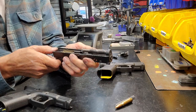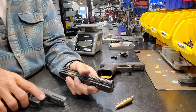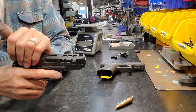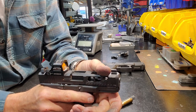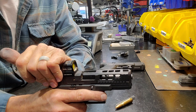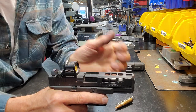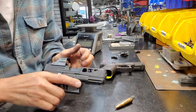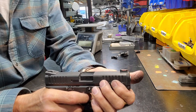Let me make sure we're all in here. It's gotta be down. All right, break the shot. So now, look, with that 4 pound spring, look what just happened. Just the fact that I put that 4 pound spring in there, it is now coming forward exactly how I want it to, exactly like this. And that was only the difference of a half pound spring. So you have to remember,